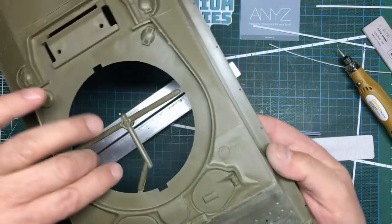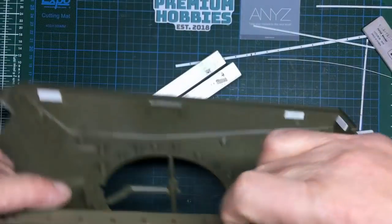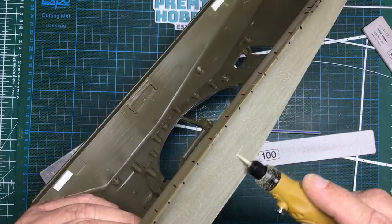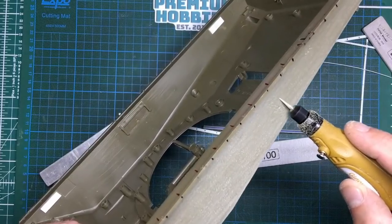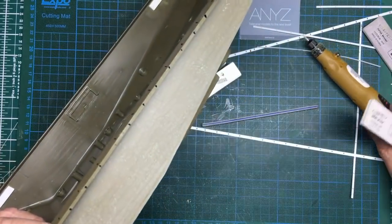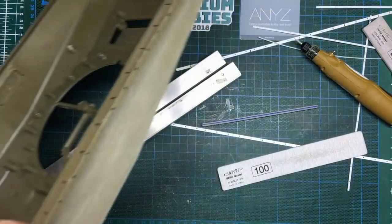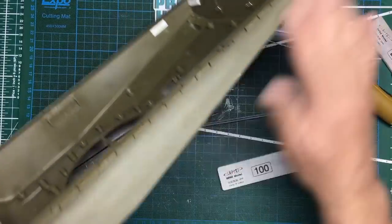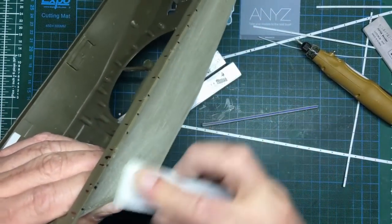This also applies to the side of your Tiger tank, because it's the same thing — it's hot rolled steel. In certain areas you can come in and put some heavy bits in there, and when you sand that it'll leave a deeper pit behind, representing areas of inclusions. Basically when it's hot rolled, all the slag and rubbish comes out of the steel, gets rolled back in, and as it cools it breaks away and leaves the pitting behind. It's used where a nice finish isn't required.